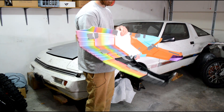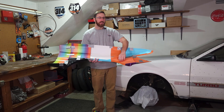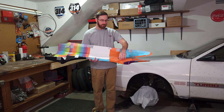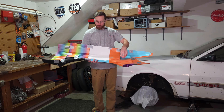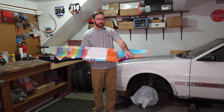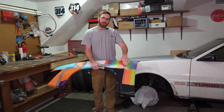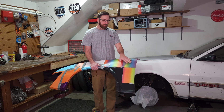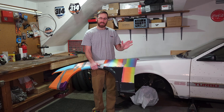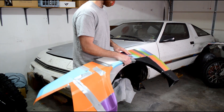A couple of other things I had trouble with: the lips to glue these pieces together really should have been a lot bigger. I underestimated how much gluing space I'd need to actually get a clamp on. Some areas I could clamp together fine with a C-clamp or spring clamp, but other areas I ended up using weights and tape to hold things. That unfortunately caused a problem because the epoxy reacted with the tape and the residue is just stuck on there — I can't get it off. I could sand it down, but at the end of the day I'm not going to.